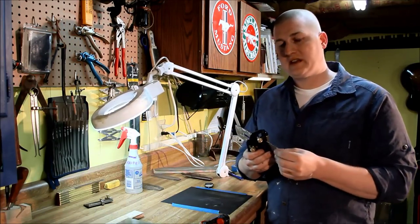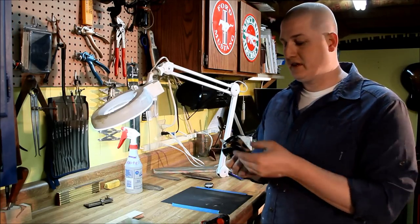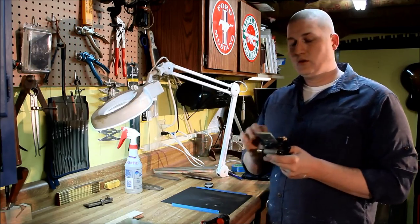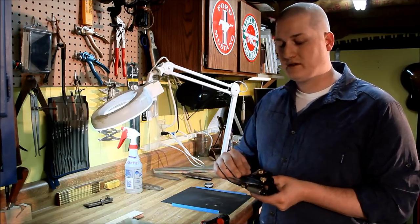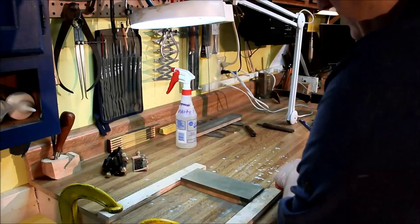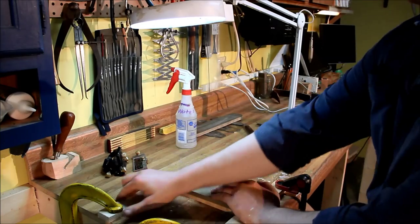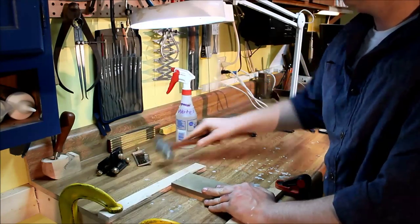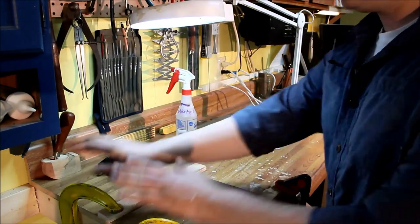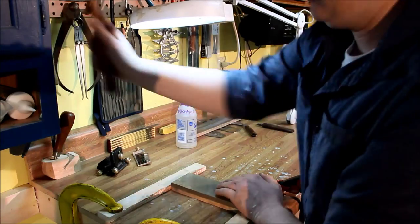So our 220 grit sandpaper did a really good job of giving us our initial bevel established here on this iron. Once you have your plane iron clamped up inside of your jig, you don't want to go moving it around, so you want to move right over to the stone. Now you can see from my sharpening station here, it's not a real complex setup, but it does work. Just got a series of clamps around to hold these pieces of plywood, which keeps my stone relatively secure.